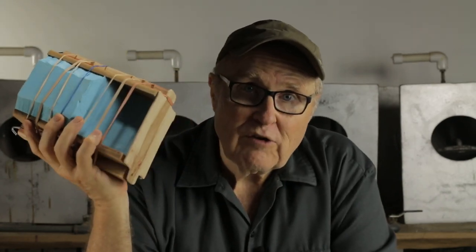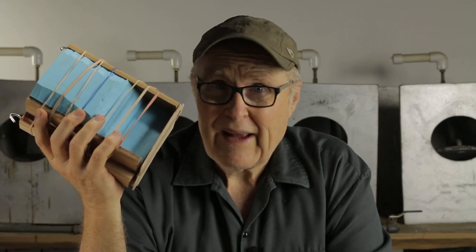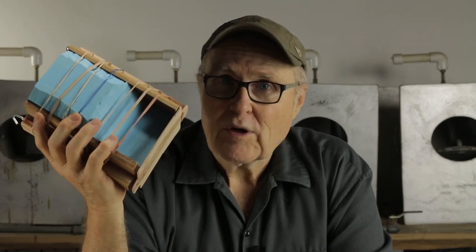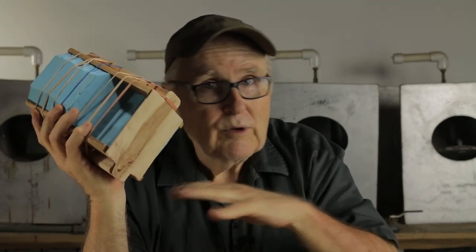You saw me earlier in this video dispensing out of a 5-gallon bucket. I buy the buckets because it's economical that way. But the downside is that a bucket can last me a year. And after a while, the resin just absorbs moisture from the air. Even if I carefully seal up the buckets, no matter what, it starts to absorb moisture. And that's what causes a lot of the foaming and the little pin bubbles that occur in resin castings. So if you're wondering why you're getting a lot of tiny bubbles at the top surfaces of your molds, it's probably moisture. That's what the tanks are for. The tanks will not remove big bubbles, but they will remove all those little fine bubbles, and they will prevent the resin from foaming.